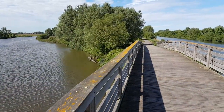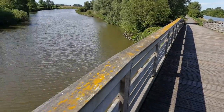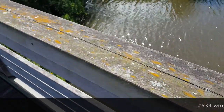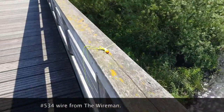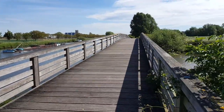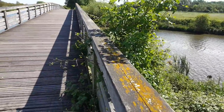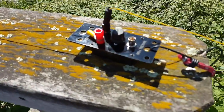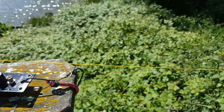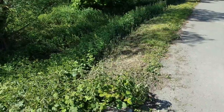I'm installing my antenna — a 135-foot wire — over this bridge, attached to the ramp. The antenna is in place and spans the whole bridge. I have the SOTA Beams Valley Tuner and a four-meter counterpoise, which is 0.05 wavelength for 80 meters.